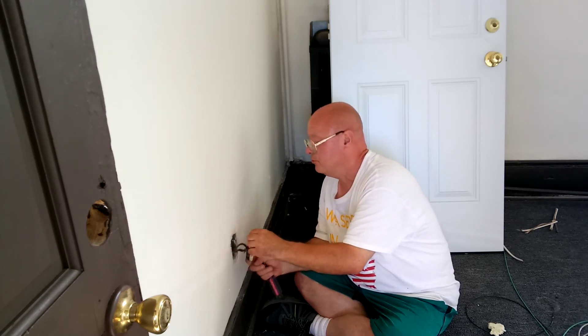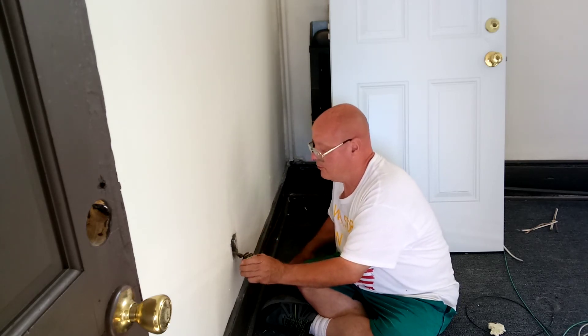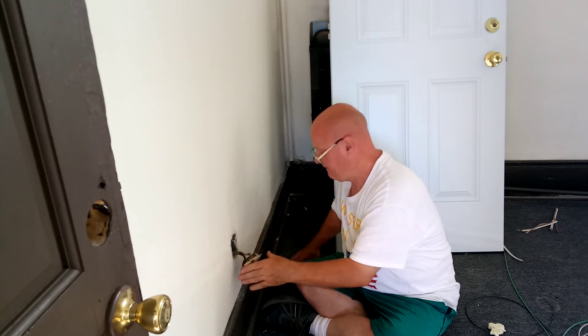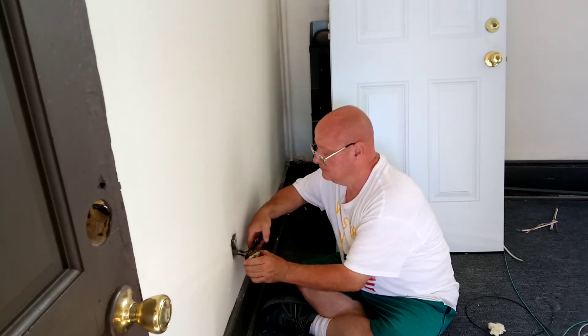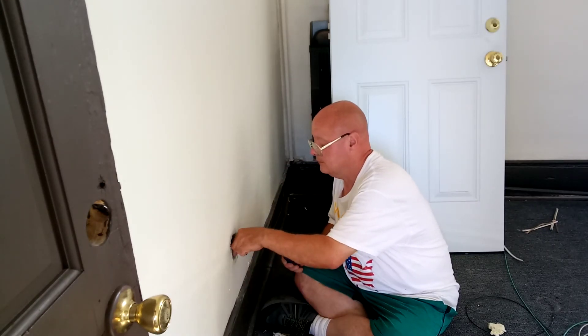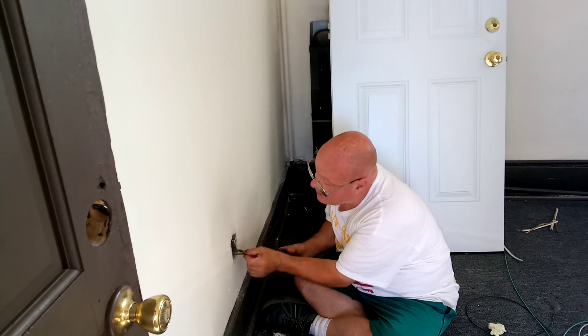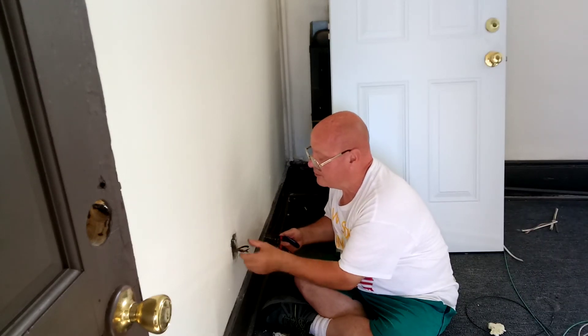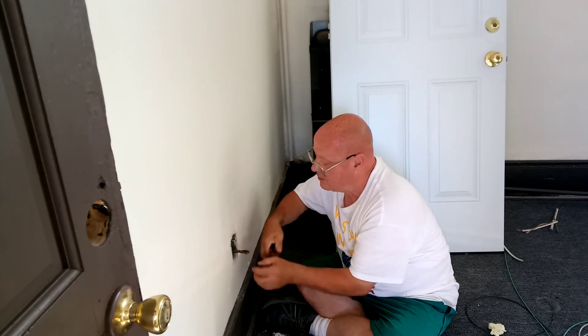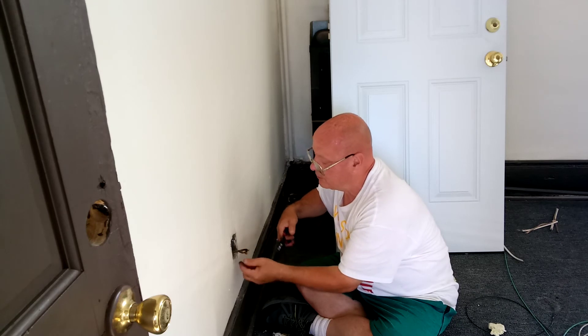There — and this has very old wire on it. So we will take this BX wire and strip very little off here so that the wire nut can grab onto the copper.